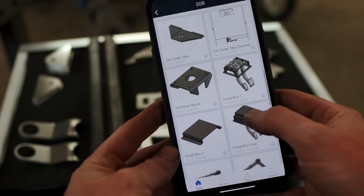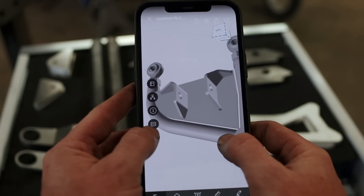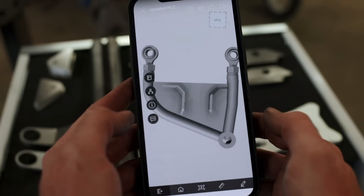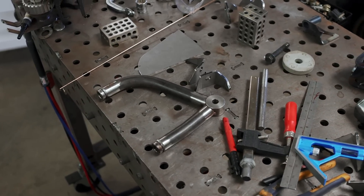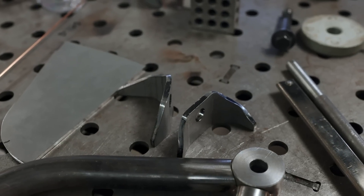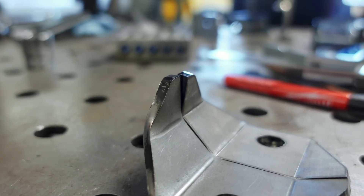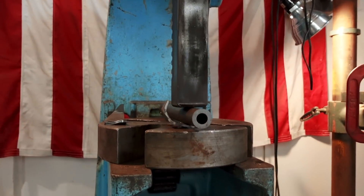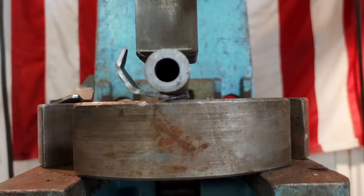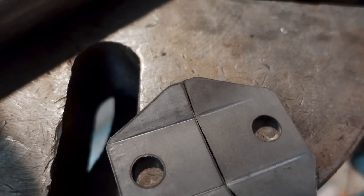One of my favorite parts about designing parts in Fusion 360 is that at any point I can open them up from my phone. For the lower shock mount brackets, it's a helpful refresher to know exactly how the brackets need to be oriented on our control arm. Having SendCutSend pre-bend these tabs can save a lot of work on the front end, but only if you remember to tell them to bend the tabs in opposite directions for opposite sides of the car. I forgot to do that, so I ended up bending some the other way — and then overbent them just a bit. We headed over to the arbor press to unbend them using a round tube placed directly over the bend, giving it a squeeze with a few tons of force to unbend without any damage to the part.